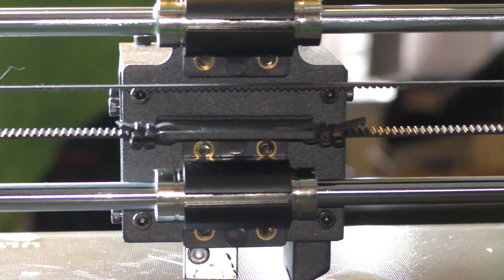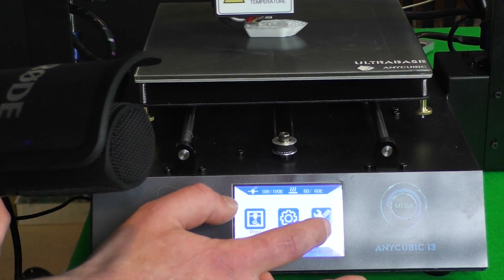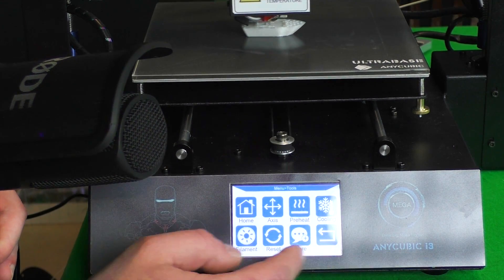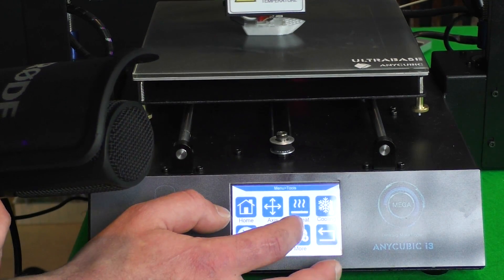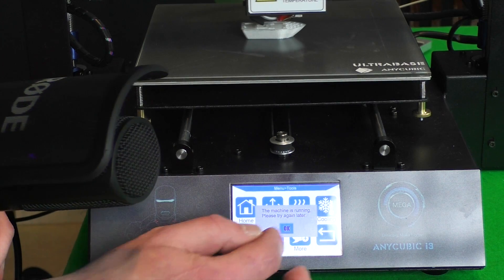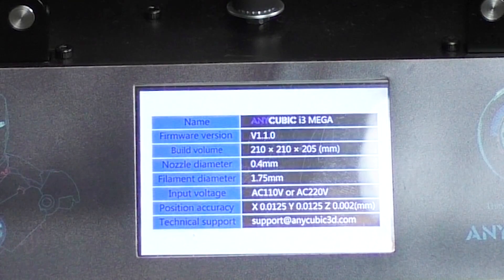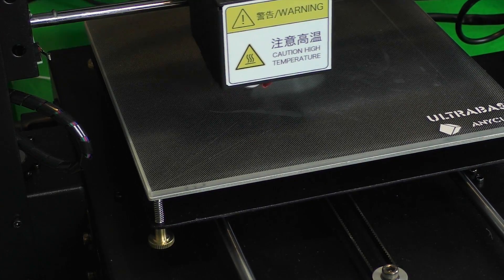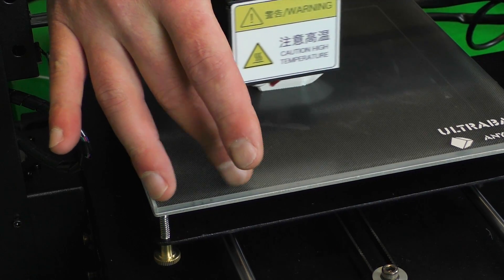You can toggle motors on and off — when you're finished you can disable the steppers to move the head around without damaging anything. There's also a status screen, and under Setup and Tools you have more options. Under Tools you've got home, move axes one by one, and cooling to tell it to cool off when finished. You can do filament load and unload from here too, and calibrate your touchscreen. There's also technical support email address on the printer. The perforated bed feels like PEI — everything just sticks to it.